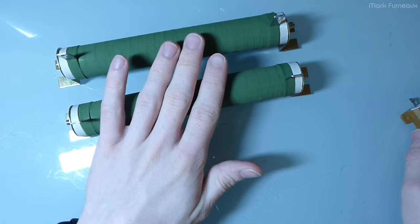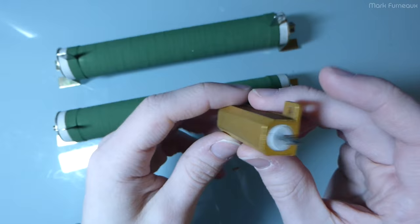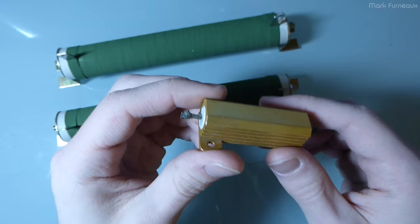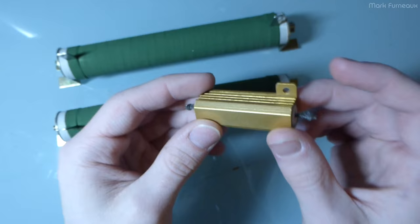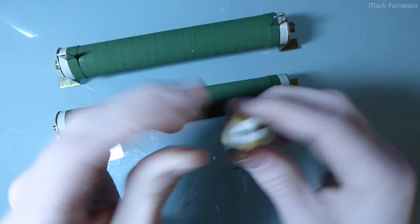The more common type of big power resistors for hundreds of watts are resistors that look like this. This one I'm not sure what it's rated for — it doesn't have any markings — but I suspect it's probably 25 watts. These are readily available and very cheap. They're just an aluminum extrusion with a core with some wire wrapped around it and two terminals on the end. The idea is you're supposed to bolt this to a heat sink.